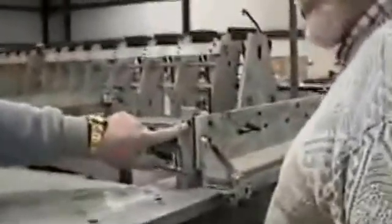Here's an assembly fixture for the canopy. Do you know that plane, the Beechcraft? I built this one too, so people can stand on the inside and work. You locate the canopy by tooling holes, which are in the bow. They start off in the bows, forward and aft bow.